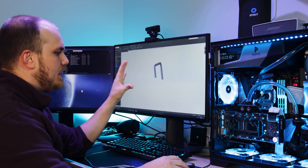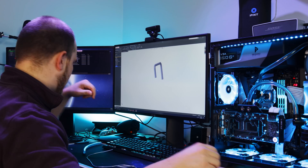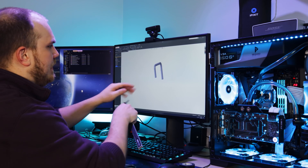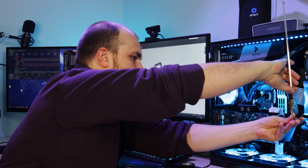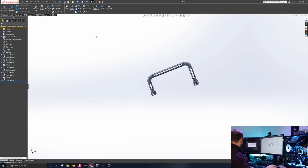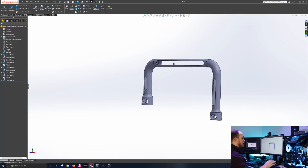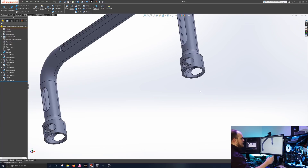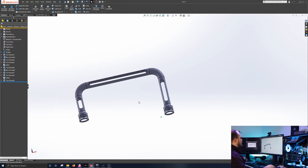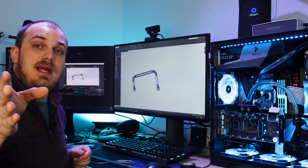So that's our tube, but essentially I want it to be tight around the tube, and I kind of want it to flare on the bottom to go around the fitting, and the fitting is going to help hold it in place. The diameter of the fitting is about 20mm — 19.9, so 20 will work. I'm going to cut it back the length of this fitting, which is about 15mm, and blow it up to 20. Welcome back — here is our first design. It kind of looks like the tubes you see in Mario's world, but that is the idea. I have cutouts here so you can see the tubing, and down here they're running horizontally so you can get your fingers in there to loosen the fitting to help you get it off and on. Now we've got to save this as STL, throw it into Cura, and see what happens when it comes off.